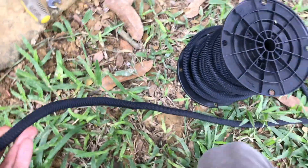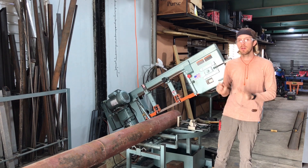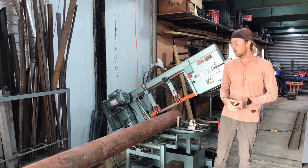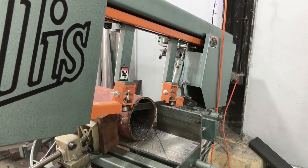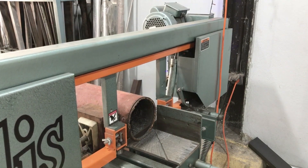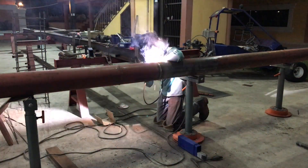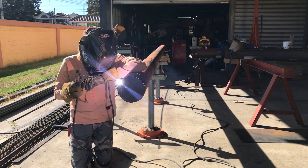I have a spool of bungee cord — I got this for about $45, it's 50 foot. For the end anchor point, there weren't any trees that I thought would be safe or strong enough or in the right location, so I decided to go with some metal posts. They recommend when using wood that if you're just using a single post, use a 12-inch post. I talked to some engineer friends and my personal opinion is a 4-inch metal post would probably work, but there would probably be some bounce in it even though it would never be unsafe. So I went to a scrap yard and found a 6-inch, just about quarter-inch wall pipe for basically the same price as buying a 4-inch one new. I'll have to trim it up and splice two 10-foot segments together to get a 20-foot pipe.